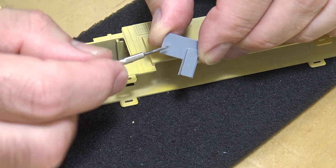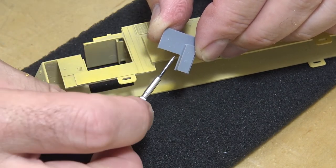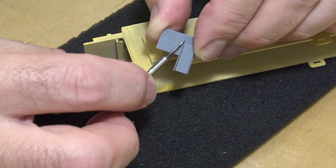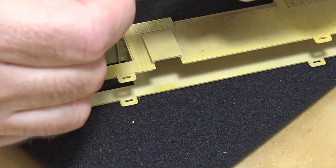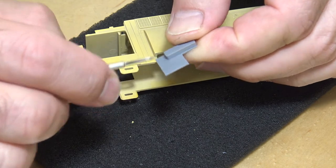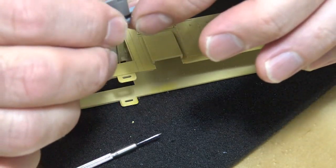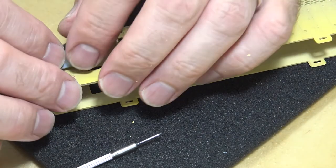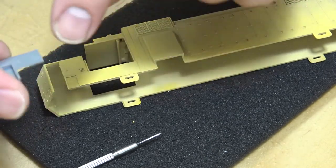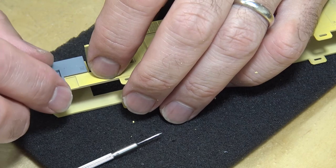Right there. So I want to cut this all the way up to the inside, or to this face of the inset. So I'm going to cut this straight down off the inset. So I'll put this in the mill, put it up like that. I'll nip this off here. And I'll put this in the mill and just clean it straight off so it's nice and perpendicular to the edges. Then I'll come back and I'll do some test fitting, because right now, once I clean this side up, the inside edge here will fit exactly where I want it.